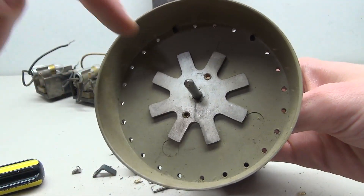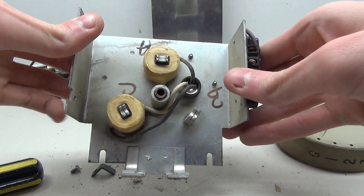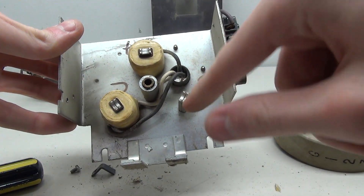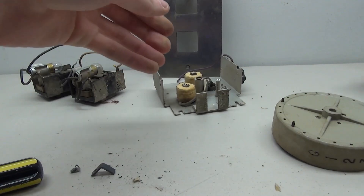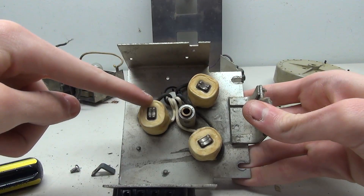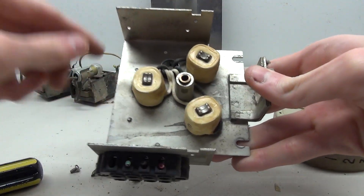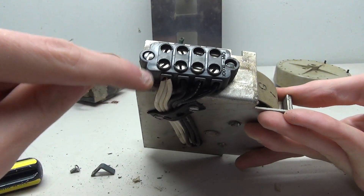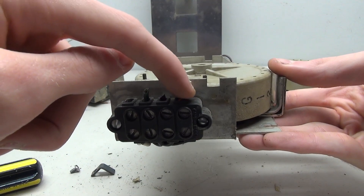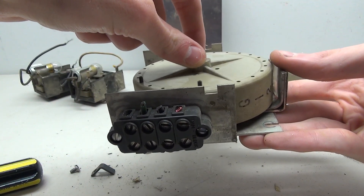This is what the inside of this dial looks like. You'll see there are metal pieces all the way around along with a little shaft in the middle. This is the base side of the rotodial, and you'll notice these three pieces. This one won't actually work because we're missing one of the components, so let's look at the other complete one. You'll notice there are three white things — these are actually electromagnets, and that's the way this indicator works. This particular one has three coils and four connectors: there's the common and then one, two, three. The common will be connected to common, and you would pulse each of these pins a certain way so that it would turn the dial one number.